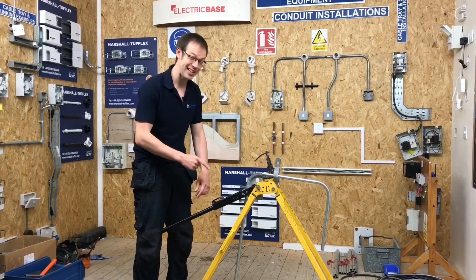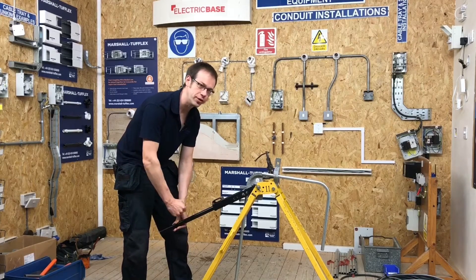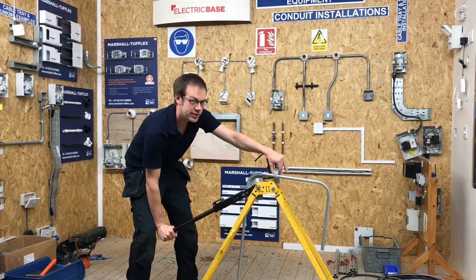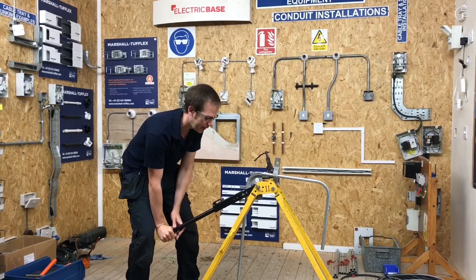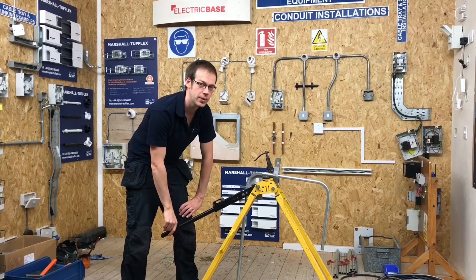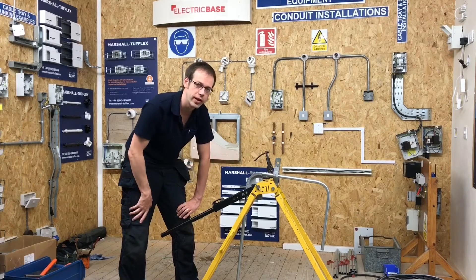They add a little more bend using a gentle motion — you can feel it start to go. The technique is to lean on the bending arm until you feel the machine tighten up and reach the position where it's about to start bending, then apply just the weight of your arm. That's probably enough, as it's surprising how much it bends with just a little bit of pressure. The conduit is then removed to check the result.